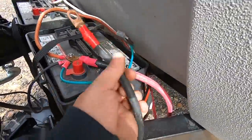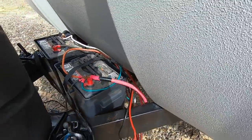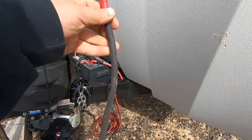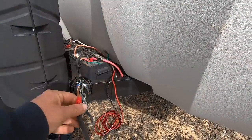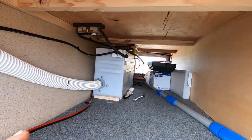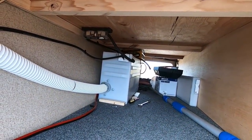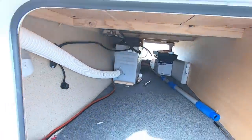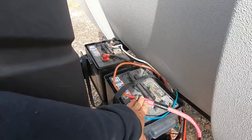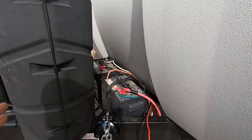This is the size wire they used — number two. We put in 4-0, not that size, for the jumper. When the inverter is running it's pulling all the power from these batteries and nothing really from the others. The charge controller power was hooked up to these two batteries alone, not the other batteries — you can kind of see where I'm going with this.